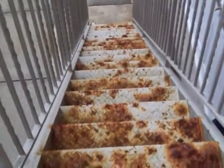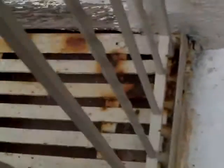This Firescape's all welded. That's a fairly new section going down here, but up here all these square head bolts that are part of the major platform need to be swapped out. Any material needs to be sistered and/or replaced. Then any joints need to be sealed, and ties back into the building need to be verified.